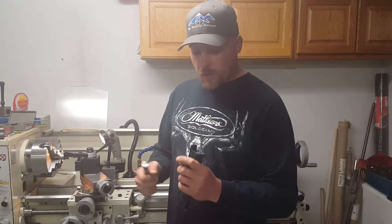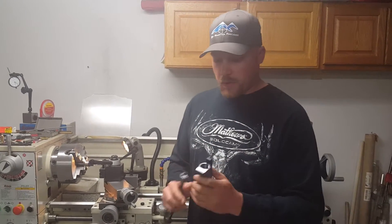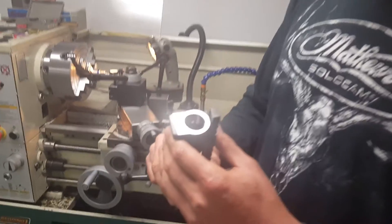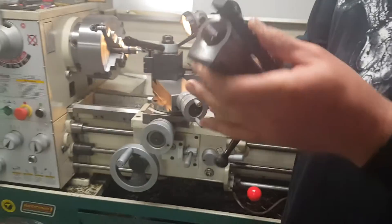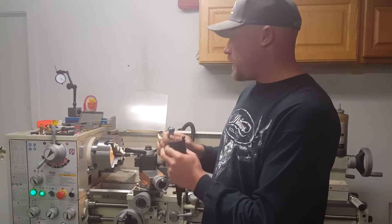I just want to go over briefly concentricity in a rifle and how important it is. Bullets in a rifle need to be concentric with the bore, and when you hear about a blueprint job and all that, there's so much that goes into keeping that bullet concentric with the bore. What I've done here is a blueprint job on a Winchester Model 70 action — a newer style Winchester. As you can see, the face has been cut on this action, and the raceway is the centerline where that bullet and cartridge sits.